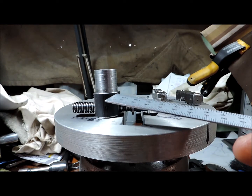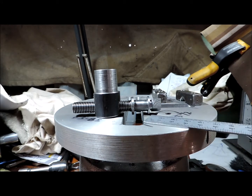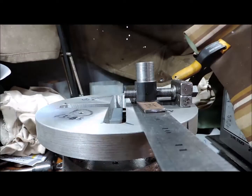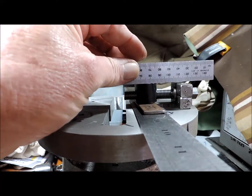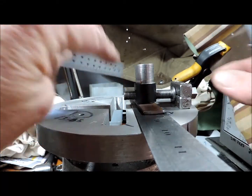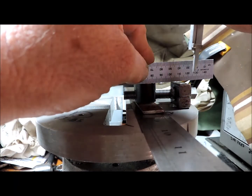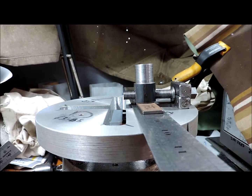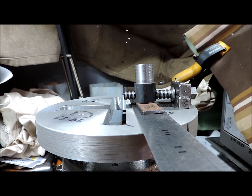The position of this shoulder in relation to the plate, the centre of the screw, and the thickness of the bearing all need to be considered. I've got 4mm of packing there now — there's no movement, so I can hold both parts down. That's going to be 22mm, so 2mm can come off. I'll do about 1.8mm, and if I have to shim, I'll shim — we'll see how it goes.